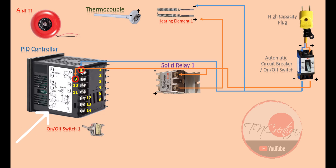So this is when the PID comes in. The PID will tell the solid relay when to be on and when to be off. To do this, we now look at number 10 and number 11 pins of the PID. Notice that number 11 has a positive sign by it, so number 10 is negative. Simply wire number 10 to the pin which has a negative sign on the solid relay — in this case it is number 4. And before connecting number 11 to the positive pin of the solid relay, let's run it through the switch, like in the video. This is the adjustment I want you all to have compared to my last posted video. This switch will either turn the relay on or turn the relay off manually. When the solid relay is off, our heating element will be off too — that's what we want.